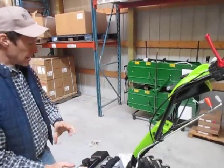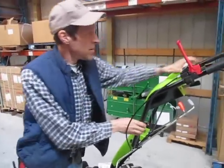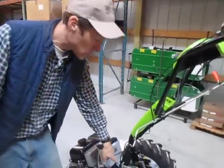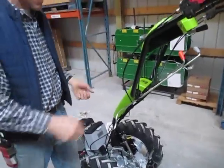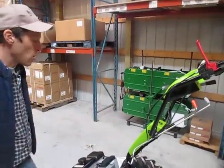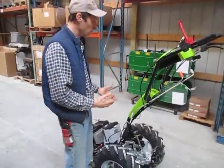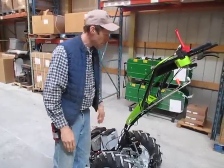The only way to screw up the smart reverse is to have it pulled back into reverse when you turn the handlebars around. What it will do is either stretch or break the cable right there because there's simply not enough throw for it to flip over. You can force it with the leverage of four or five feet of handlebar, but my recommendation is if you're rotating around and you feel resistance, stop and look for something that might be wrong. You don't want to be pinching anything — all these cables could get pinched.